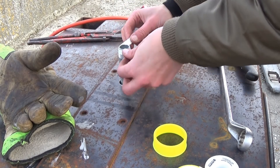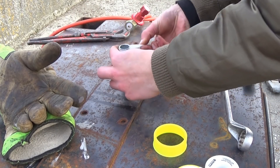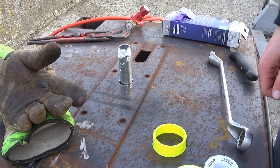It was then just a matter of screwing on the pipes through which the gases and fumes travel to the condenser. To get the links sealed I used a Teflon sealing tape, which is resistant to the hydrocarbons and acidic components that can form.